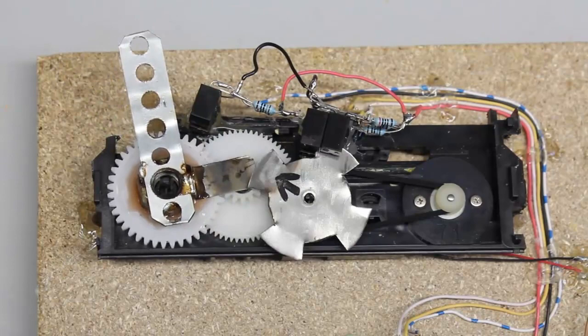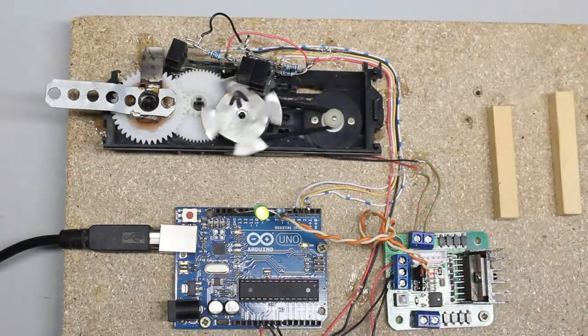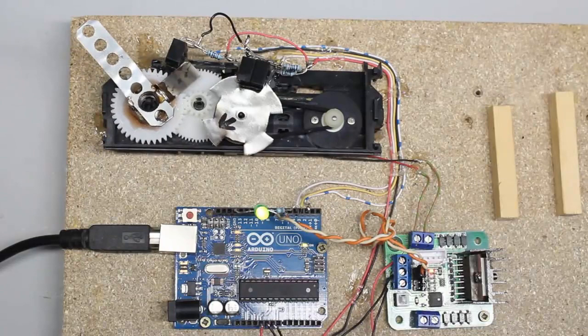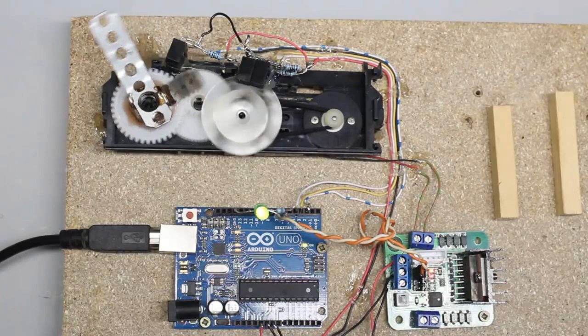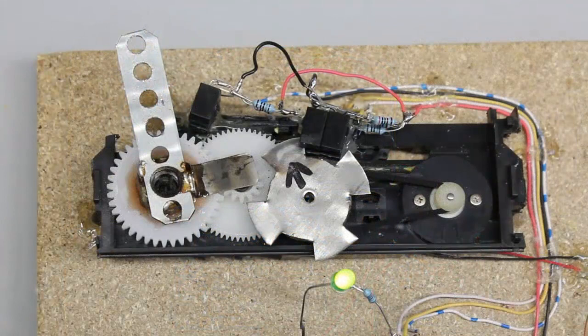Note that there is always clearance caused by a transmission, which lowers that theoretical value. You get a very precisely controlled digital servo whose maximum angle of rotation only depends on software parameters — it can be approximately 180 degrees or a full turn of 360 degrees. Whenever that servo is turned on, the Arduino has to find the actual position of the servo lever, and a limit switch is needed.